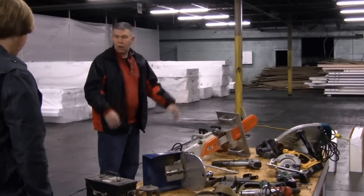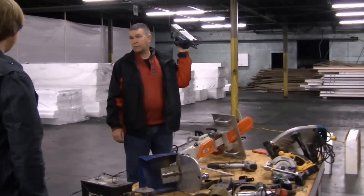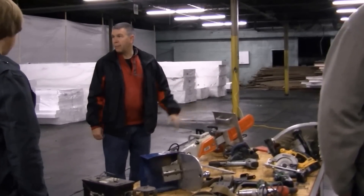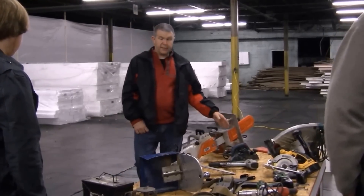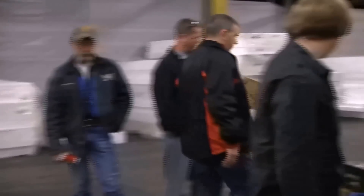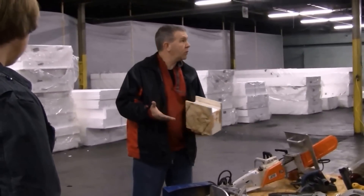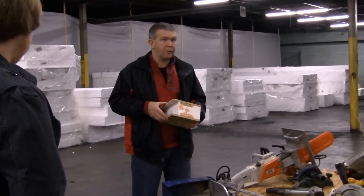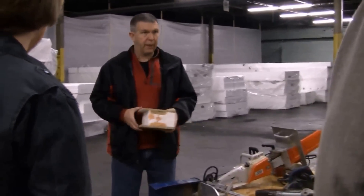So we're cutting panels. When we're cutting panels, the next tool I probably use the most often is the power plane. I do that because it makes panels come together easier, and it works a lot better when I'm trying to fit a piece of panel. Don't be afraid to grab that power plane and just shave off an eighth of an inch or sixteenth of an inch at a time if that's what it takes. We'll also use this to hit the inside corners of the panels so that the panels will come together better, because when you have dimensional lumber sitting in the skin of your panel trying to drop down, it's these little corners — or even the corners of the lumber — that will get you. If you've got beveled lumber like a valley or hip beam, they really want to bind up. Time spent with that power plane rolling the edges of the inside corner of the panel or the lumber means the panels are going to come together a lot better.